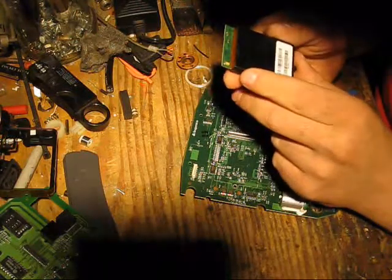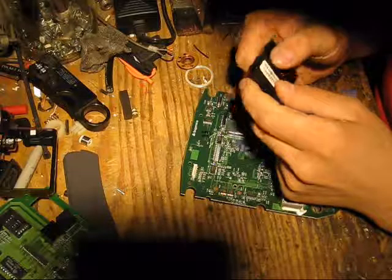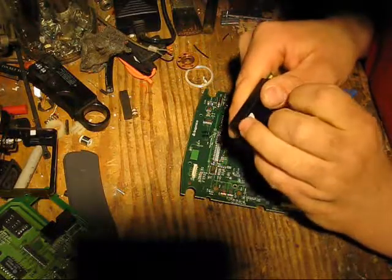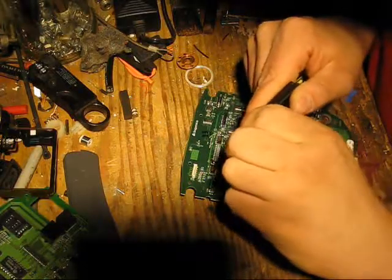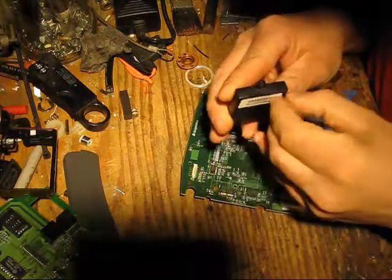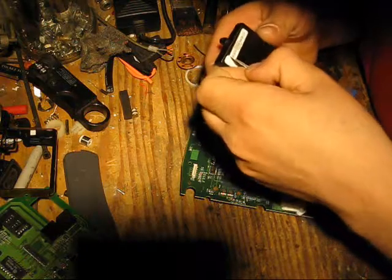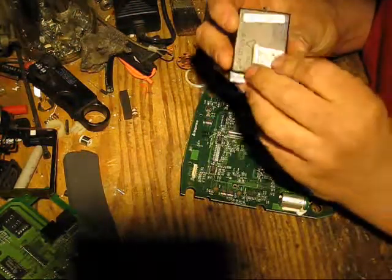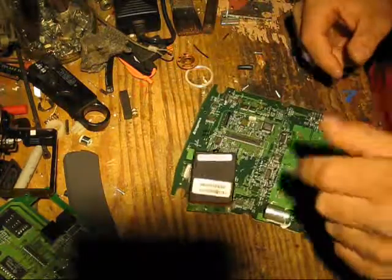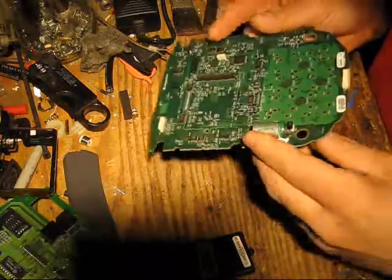Box 321230B, SEN 7235-11F. I don't know exactly what this thing does, but I'm guessing it's part of the encryption. It would be cool to get it open, but opening it would probably destroy it beyond repair. As it is now, if this was sent back to the factory, they could reload the encryption keys — put it all back together and send it in and get it back to operating. Basically it's a volatile memory thing, and removing power just makes it erase the memory. It probably meets some kind of FIPS standards or government standards for encryption. They've got to be auto-zeroing if it's been tampered with.